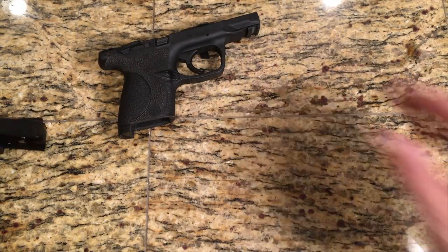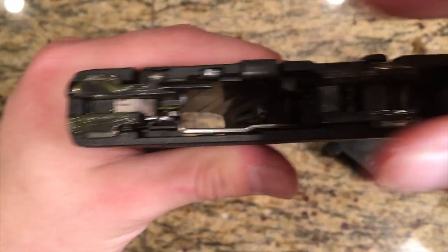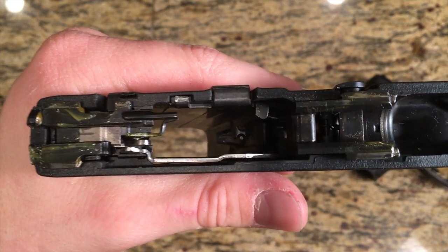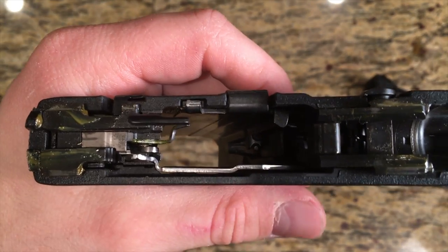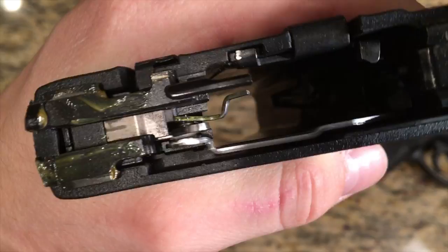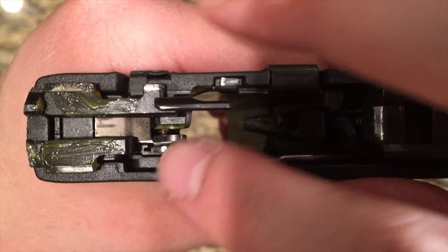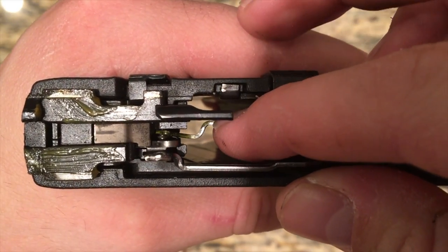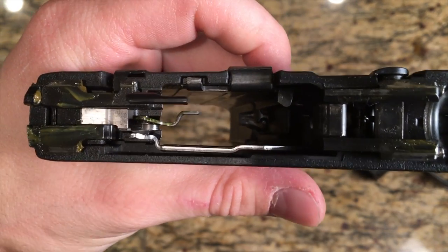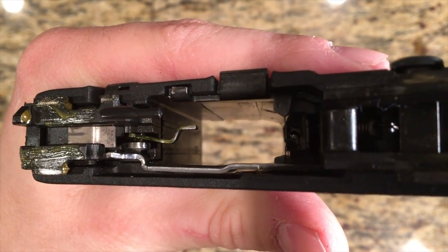The reason I'm making this video is to show you some trouble I ran into with the Shield. Showing you the issue, I have the slide already taken down. Let's pretend the slide was still on it, locked forward. We're doing it the way Smith & Wesson recommends and we push the lever down — then your slide can come off. However, that's not what happened with me. This lever can actually come off to the side a little bit. Sometimes the trigger will pop it back into place, but it can actually get even further down. This is exactly where the lever was for me, and with the slide on it, it was really hard to see. It was a brand new gun and I got super frustrated. I did a whole bunch of research on these pistols and came across that this lever in these guns is a huge issue for a lot of people.